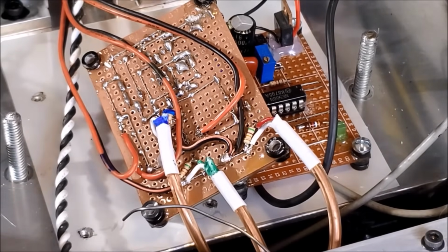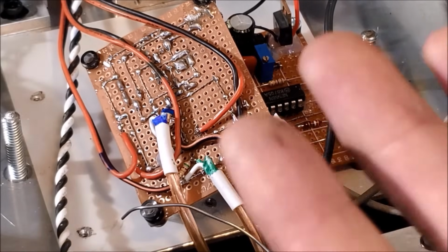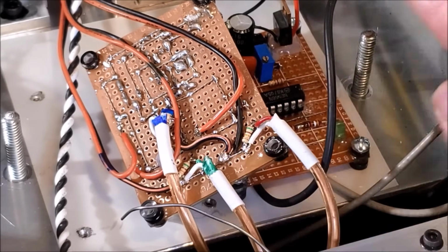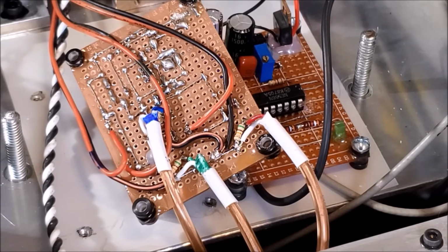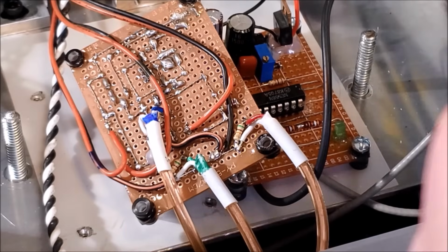Now, there's a couple of other things that need to be added to this to make it capable of applying for a variance, and that is the external shutter switch, an interlock key switch, and a switch inside of the laser, so that way if you take the cover off, it goes off. And I have this long section of wire here. We're going to eventually integrate that into everything else, but right now I'm just going to do a direct run from 24 volts on one of the laser driver rails, and sorry, laser power supply mains to 24 volts, switch mode power supply, doodads, things. So let's go ahead and wire this up.